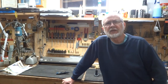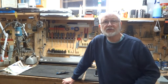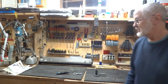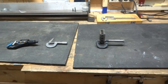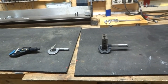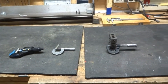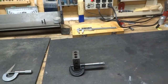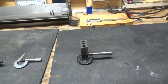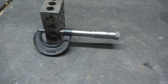Accurate just means that it is linear, repeatable, and gives you the right answer every time. If you don't have any gauge blocks — and gauge blocks can be quite expensive — there are other ways to roughly check out your micrometer. If you happen to have one-two-three blocks, you put your micrometer across that. If it's a one-inch mic, you put it across the one-inch side and you should read, of course, one inch.